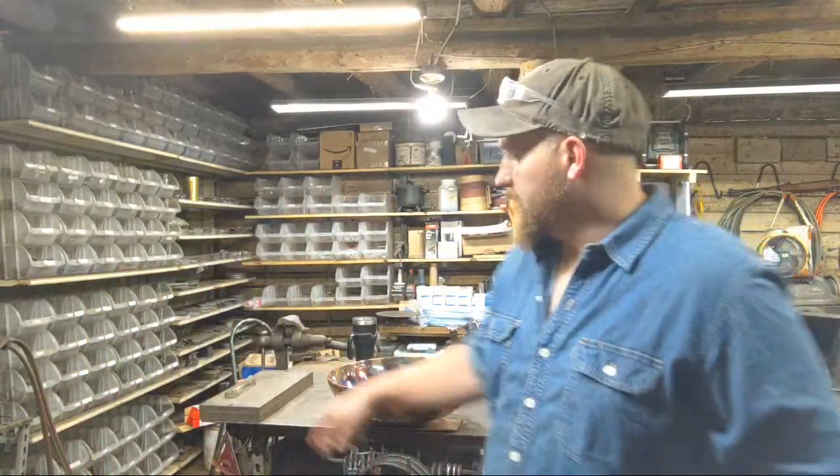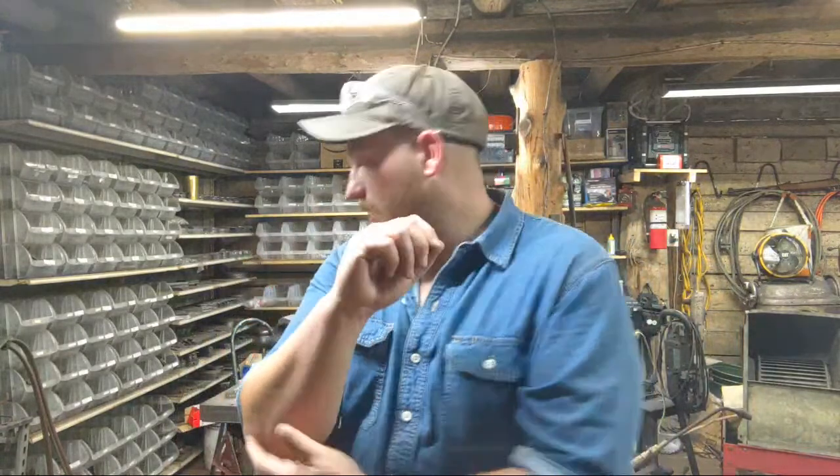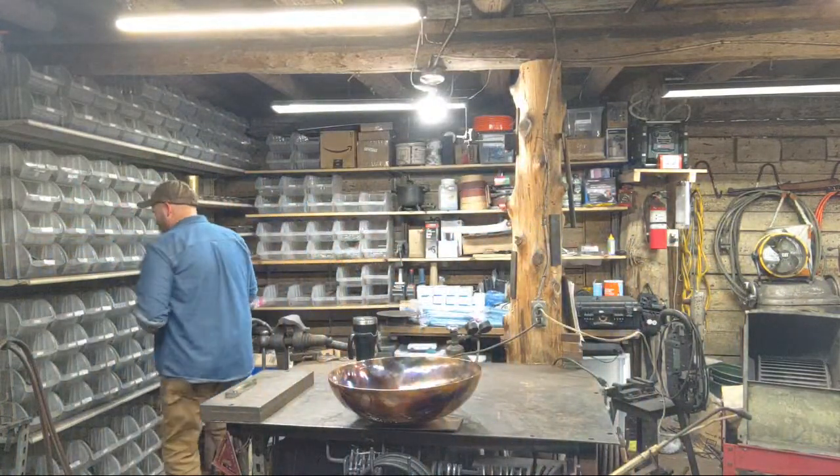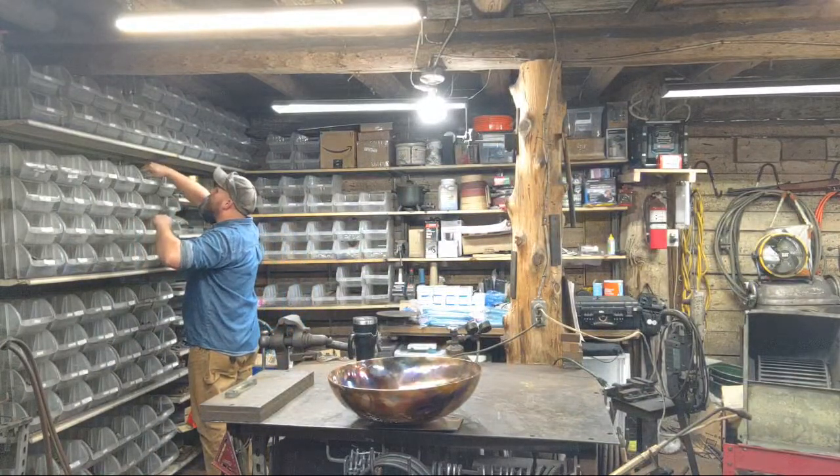Tim O'Connor, yes, it clears off the slag really well, and it gives the whole blank a nice finish. What we have been doing is using this magnetic chuck here and wire wheeling each and every order, and that's fine until somebody orders 50 to 100 of something. When somebody orders 50 to 100 of something, it takes like an hour plus to wire wheel all the plasma slag off of the blanks. And it's a nightmare. But if you guys stay right here, let me try to find you an example of the difference.